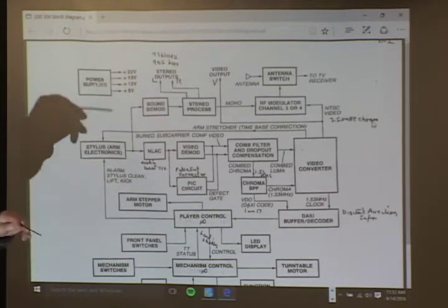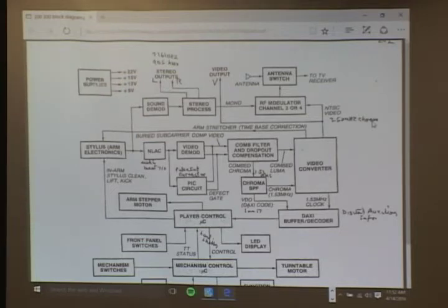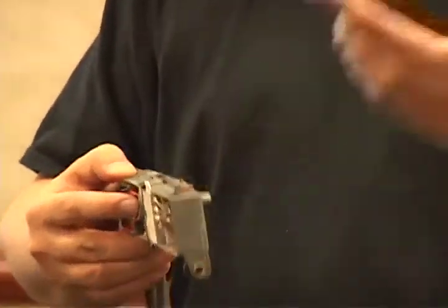Do you want me to show the part? This is the one for the JK. It's a little coil on the back. It's this coil right here, connected with these weird wires. This is the cause of that wobble. Anytime you have that wobble where the screen looks like it's doing that, I've never had it not be this, but it could be something else. You never know with these. So you just have to change that whole part out, basically?